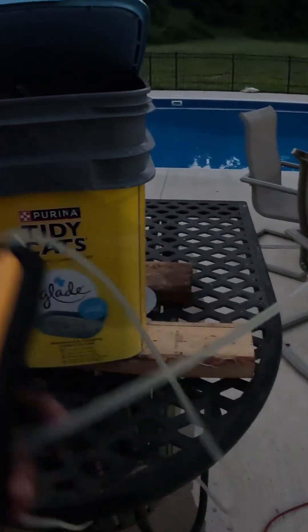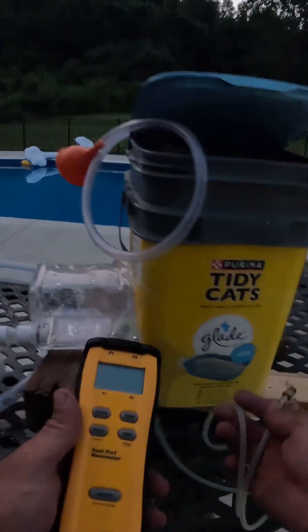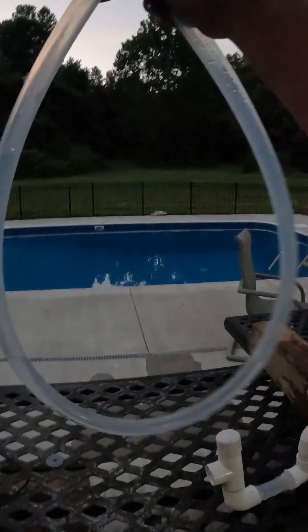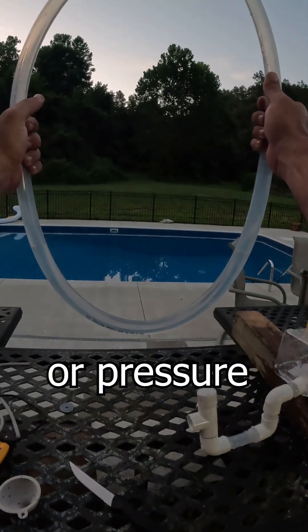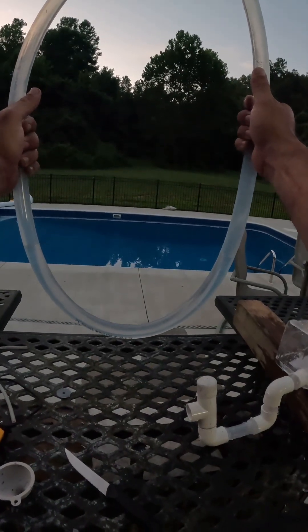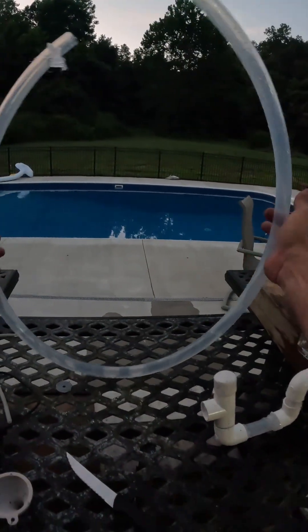For those who do not know, this is a manometer. This is how we measure pressures in inches of water column. If you look at this tube you'll see a water line — if we were to put vacuum on one side or the other it's going to make that water lift up, and the more vacuum the more it lifts up on one side. That's how they measure inches of water column — how many inches it would lift that water up. Alright guys, it's hot, I'm going inside — we'll see you on the next one.